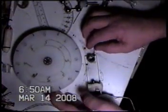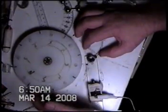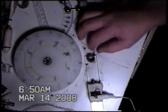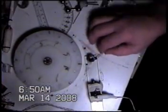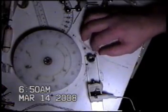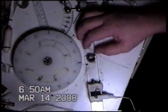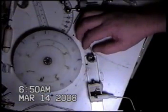The other way is we actually get like a synchronization. You see how the rotor is synced there? And we get that synchronization when we're rocking back and forth. Then just as we're passing the equator, just as we're coming up to it, we kind of pull it away, and that does the same thing. So in one case we're attracting, and in the other case we're repelling. You can either push on the backside of the hill, or you can pull on the front side of the hill.